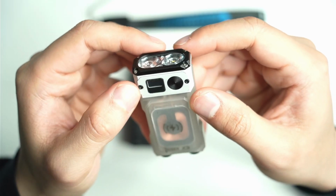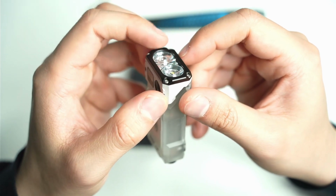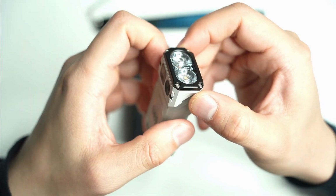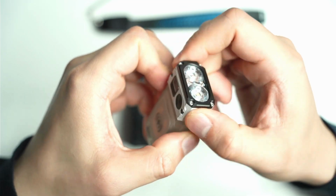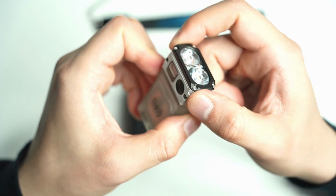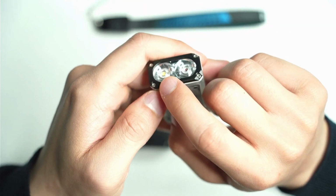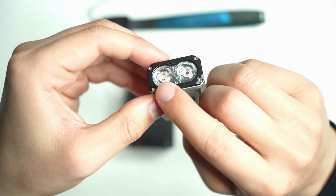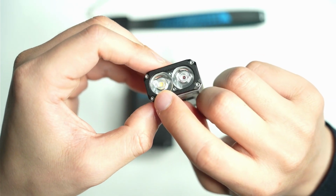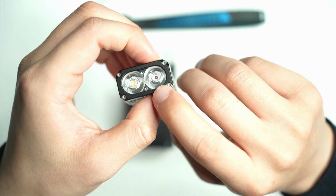This is a little close up of the head of the X3, and like I said before, mine comes with micro arc oxidation. It's pretty solid, and that essentially acts as the heatsink for both LEDs. And the LED here with the yellow bit in the center, that's the LH351D, and the 620 nanometer red LED here.